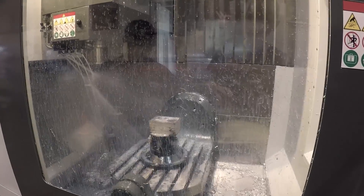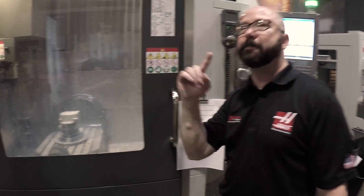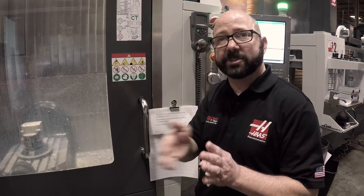We're going to make chips. That is about 300 inches a minute — it's in metric mode, so 7,500 millimeters a minute. You can see it squealed on this side because I didn't give it a dynamic toolpath on the other ones. I wrapped it in and kept a nice constant radial chip load, and it was happy.